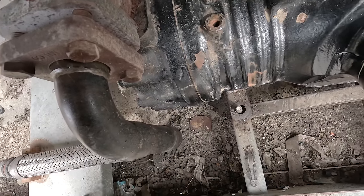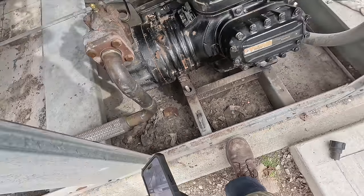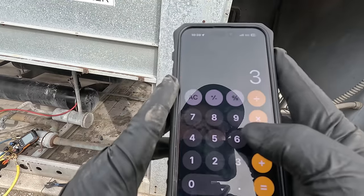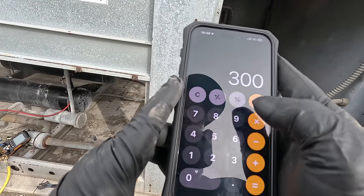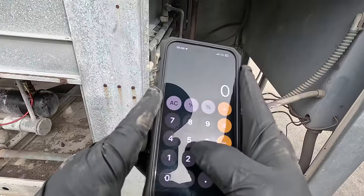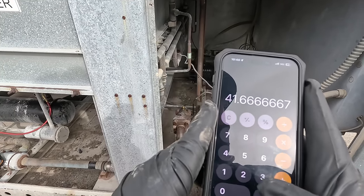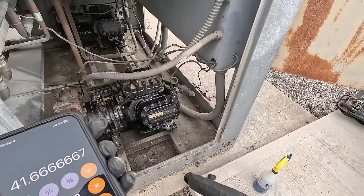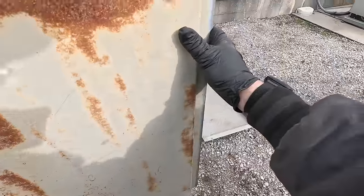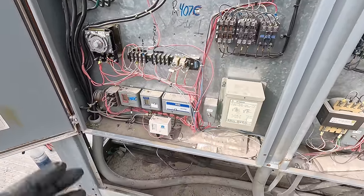This is maybe a 3R something - a Discus. I can't read it because the tag came off. Let's just say 300 inch-pounds. There's 12 inches in a foot, so 300 divided by 12 would be 25 foot-pounds. At 500 divided by 12 it would be 41 foot-pounds. I was doing 35 - I guess we're just going to stick with 35 and see how that does. Let's get down there and see if we can tighten those bottom nuts up.